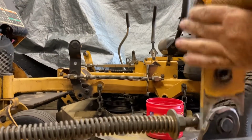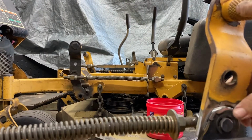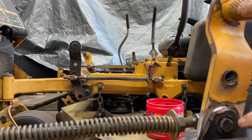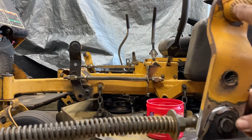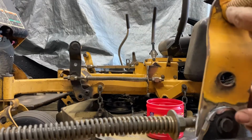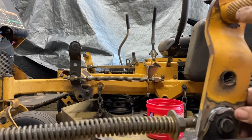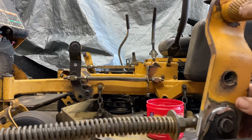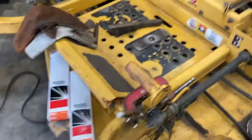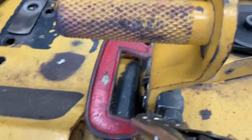So by grinding it to only this degree and having that gap to fill, the weld lets me retain this backside point, which then I can clamp in line with that, and I won't have a twisted setup like I do on that other one where it's clocked this way or that way. So I leave that. I'd rather fill the gap than have a poorly aligned control like on the other one. Having trouble holding everything, so I threw a little tack on there. I learned to only put a small tack, because you got to check this from every angle.